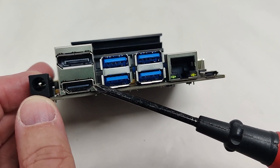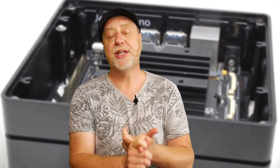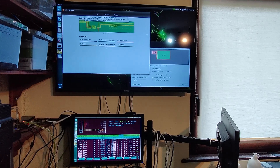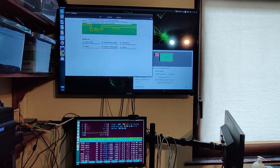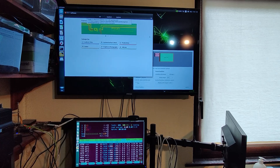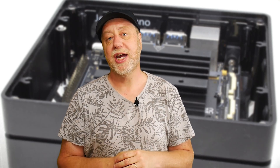Another great feature is that you get both HDMI and DisplayPort, and you can use it in a dual monitor setup. In a quick test I did, the big screen at the top was a 4K one and the one below was full HD. The software handles it all — you can configure monitor orientation, resolutions, and everything just as you'd expect, and it works out of the box. So you get the M.2 slot for an SSD and dual monitor support — two great features of the Recomputer J1020.